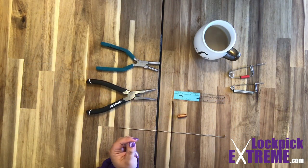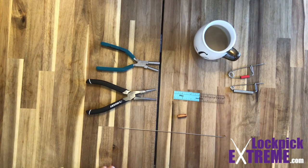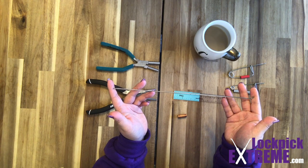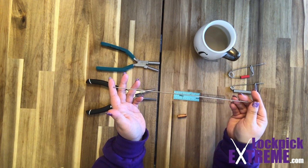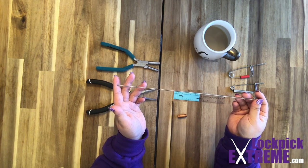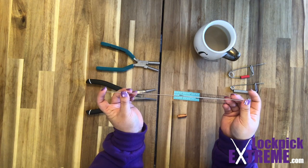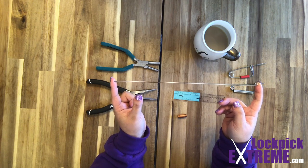I've gone ahead and cleared up my workspace and left out my two pliers, ruler, one spinner and one bike spoke. A quick note about these bike spokes: the ones that come in our kit are 310 millimeters in length and have a diameter of two millimeters. I spent some time visiting bike and cycling specialty stores in several different areas and even a different state, and the longest I could find was 302 millimeters. I've made snap picks with 302mm spokes and they do work, but there's really no room for error — if any part of the pick ends up too long, you're not going to have enough length to reach the back pins in the lock. That extra 8 millimeters from the 310mm spoke makes things a lot more comfortable.